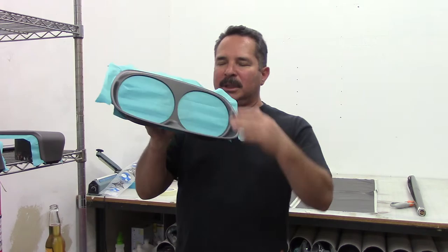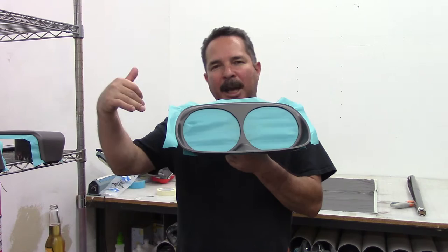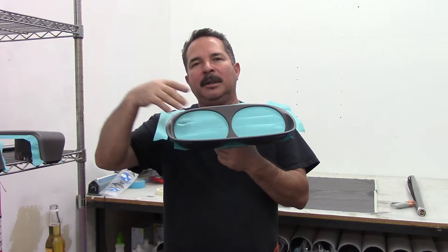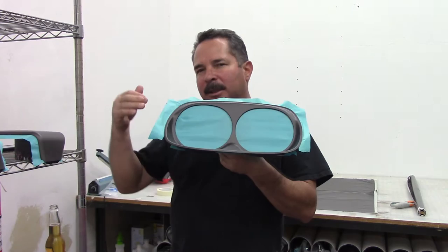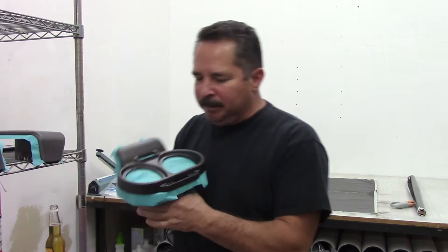What you're going to notice is that we have back taped the holes here. The problem, if you don't back tape, especially the trailing edges, you're going to get burned. In other words, the pattern's going to maybe tear out here instead of flowing off onto the tape, giving you a nice clean edge. The other thing that happens is the pattern gets sucked in. So you're going to have even more pattern stretch if you don't back tape the openings. There's other things that can happen when you don't back tape the openings — the water can actually rush in and get ahead of you on the pattern. For Harley parts, this is kind of a more detailed video, so that's why we did this one this way.